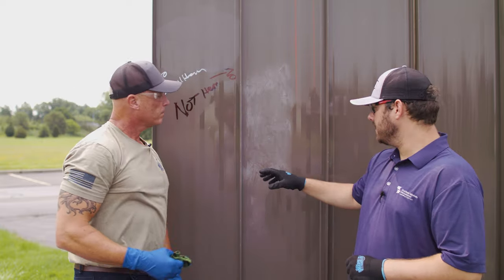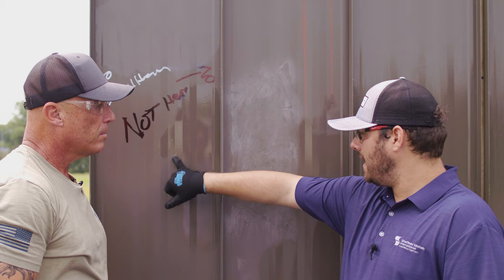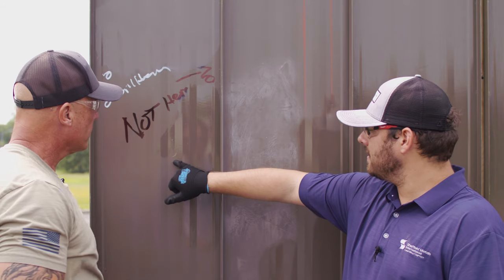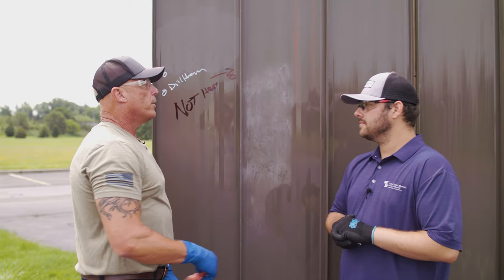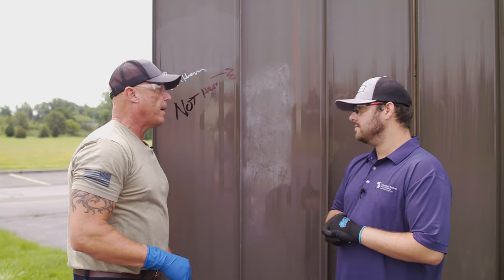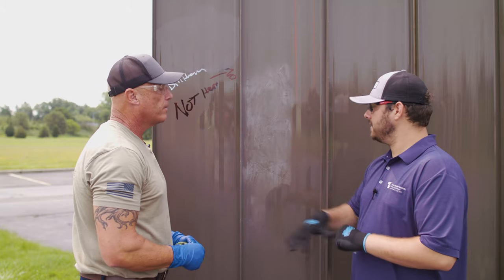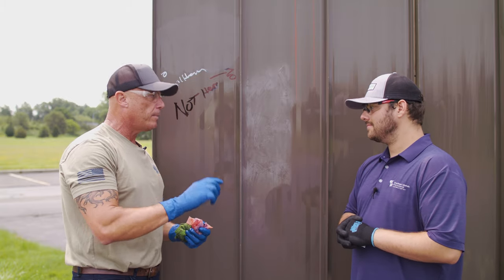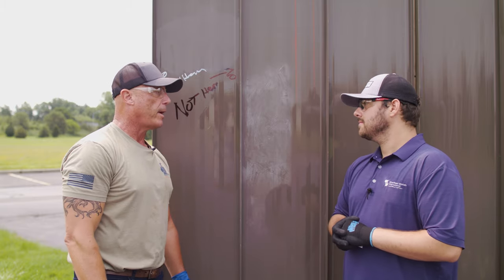This brings up a good question about paint pens — Sherwin-Williams sells through Sheffield Metals an air-dry PVDF paint pen that matches their paints for touching up scratches. Will Clean Sweep damage that? Usually when cleaning panels, you go through once cleaning all contaminants, and then come back to apply the paint pen — so you should be fine. Always test your areas first, and you can always come back and re-touch an area. The products can also remove ink pen markers and spray can markers — test all markers on your panel.